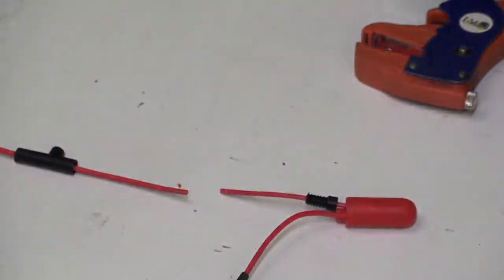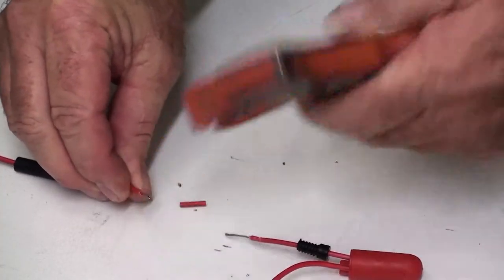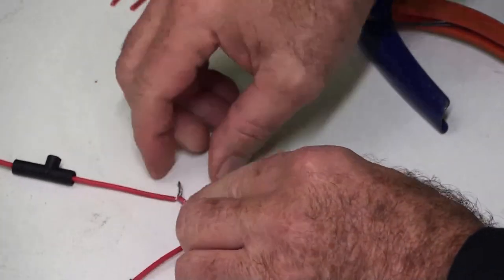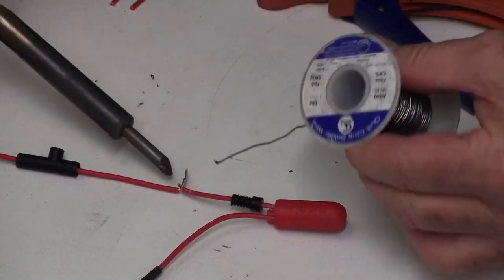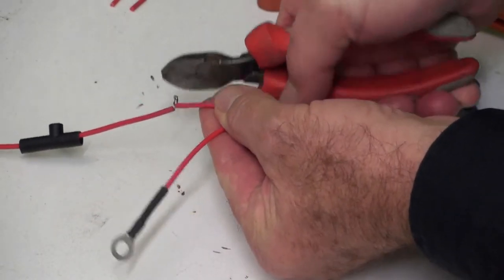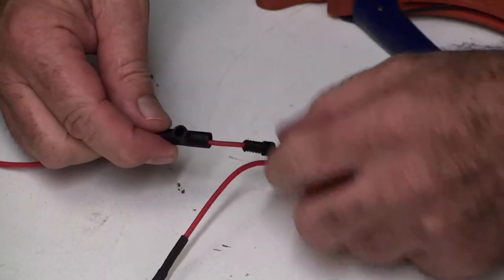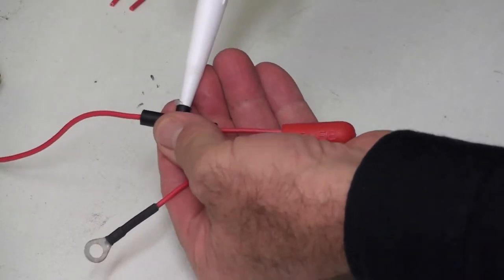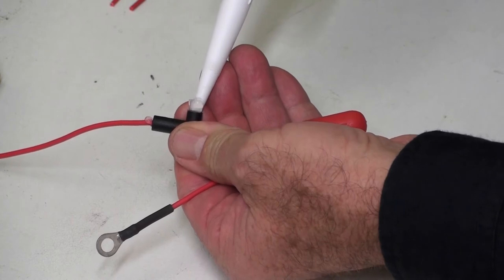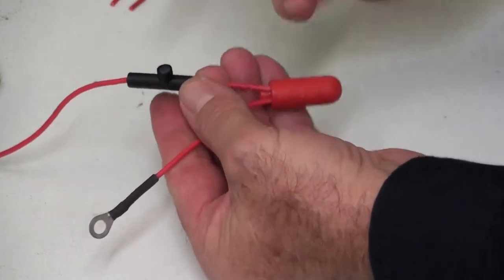Connect the fuse by removing the plug from the straight joiner, push the wires through the joiner and the plug, strip the insulation and twist the wires together. Solder the joint, then trim off any excess wire, pull the joint back inside the straight joiner and reinstall the plug. Ensure the joint is positioned centrally inside the straight joiner by viewing it through the silicon injection port in the top. Now inject the joint with silicon through the injection port, continuing until silicon can be seen squeezing out around the wires. Use a standard roofing or guttering silicon — preferably clear as it flows better — and ensure it is marked neutral cure as this is acid free.